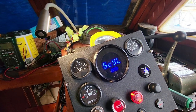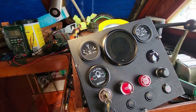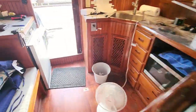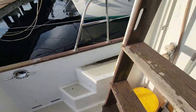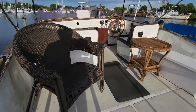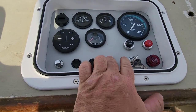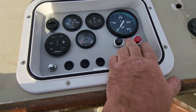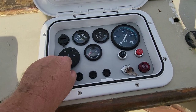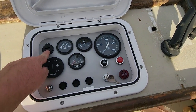So now what I want to do, and the upper alarm should be coming on, everything should be reading right, I want to shut this down and leave the upper one on. So I have no residual power down here. That's a separate circuit just for the horn. Let's see what's going on up there. I don't want there to be any kind of power draw up here. All right, all the gauges are off. Lights are off. Warning's off. Let's test this. Nothing. Nothing. Horn's gonna sound, because again, that's a separate thing. So looks like this whole panel is dead. And as it should be.